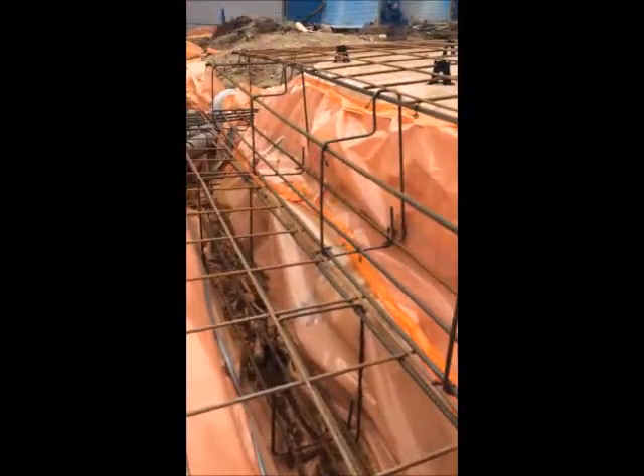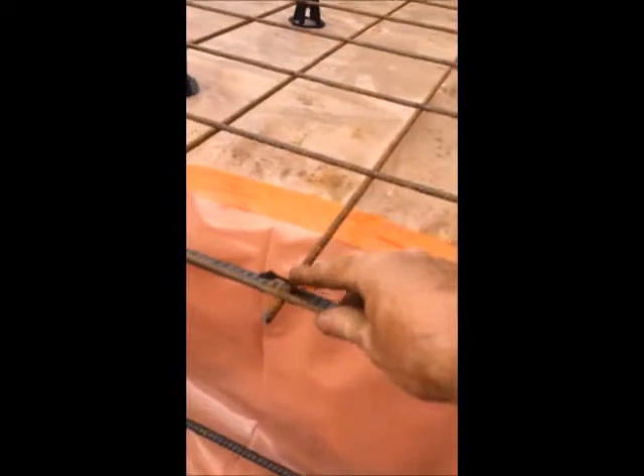On the top section here we've got our slab mesh. What you'll notice is we've run the horizontal section parallel with that beam on top and it gets tied to it, so you don't just have the bars coming across — you actually run that mesh next to the beam.